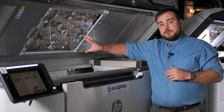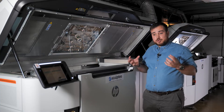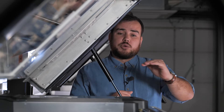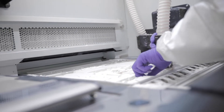Once the material layer is sprayed, fusion lamps are used to heat the powder, which enables two things. First, the powder that has been sprayed by the fusing agent will solidify to obtain a layer of material. Second, the powder sprayed by the detailing agent will mark the separation with the finished object. After that, the platform goes down a notch, a new layer of powder material is added and treated in the same way, layer after layer, until we have our finished object in its powder cake form.